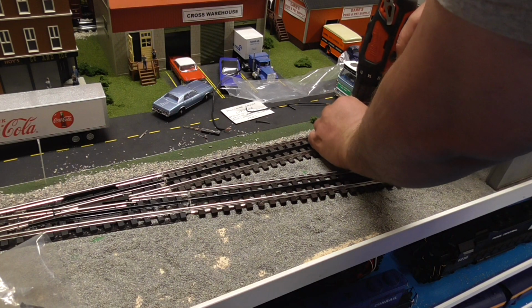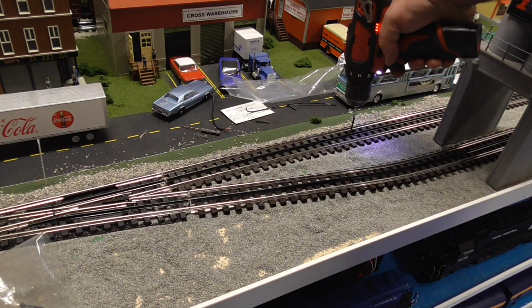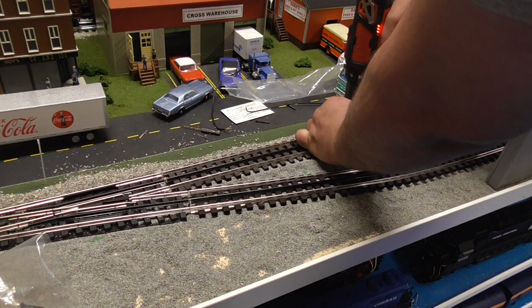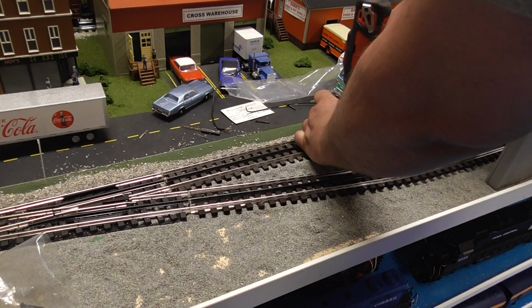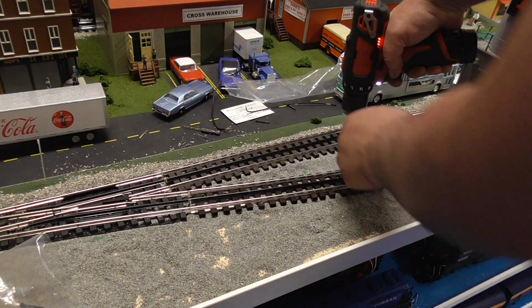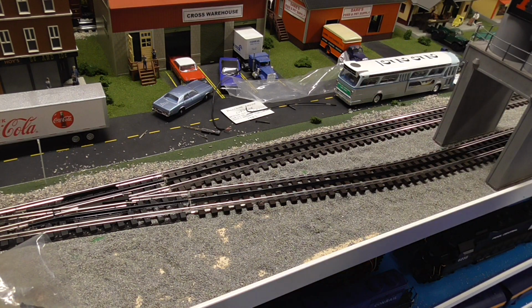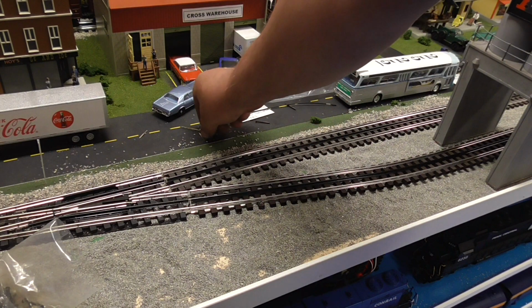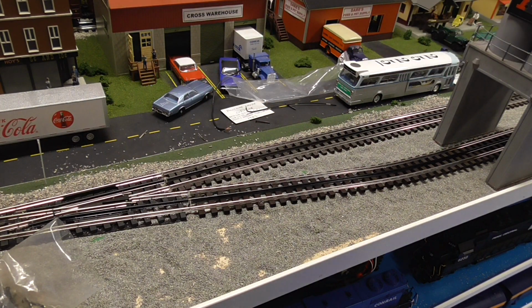Well, here's the problem. First of all, for those who don't know what a TVS is, that's a transient voltage suppressor. And its job is to keep out large spikes from your electronic devices. The problem with a TVS, it's a one-time use. And on top of that, you don't know if it's blown or not when it does blow.